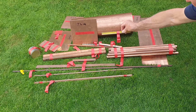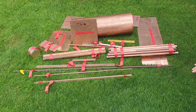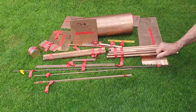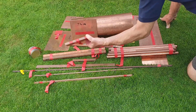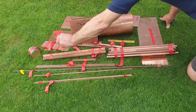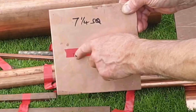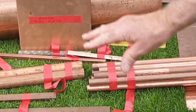These include part and parcel of the foundation ring, the bracket to hold it so it can expand when it gets hot alongside the frames, and these are the plates to make the outer wrapper and the back head plates for the boiler. These are the parts that will go across the top of the firebox forming the crown stays or the girder stay. I've itemized all the pieces with a piece of insulation tape and written on them what each item is for easy and quick finding as I go through the build.